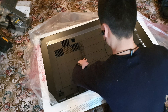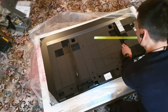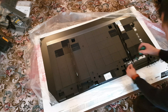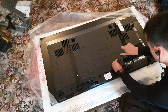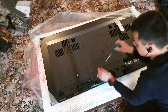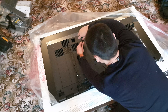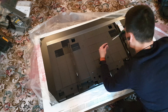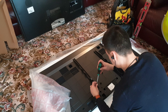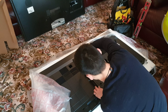These are the arms from my old bracket which I shall reuse. The mounting is 300 by 300 square. There are four M6 20mm bolts coming out of the back of that TV — they've got retaining washers on them — and I shall use them to reattach the arms to the TV. I'll gently fix those arms to the TV, nip them up, and push upwards to take up any slack in the arms.